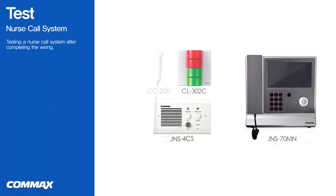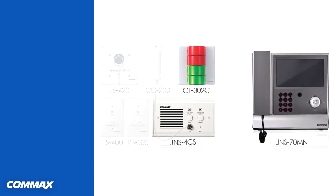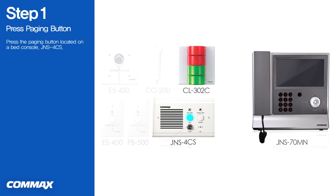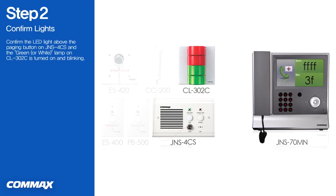We would like to demonstrate how to run an initial test after wiring is completed. First, press the paging button located on a bed console JNS4CS. Please confirm the LED above the paging button on JNS4CS is on and the green lamp on CL302C is turned on and starts blinking. Please confirm the JNS70MN displays FFFF room on the screen, indicating a patient from the room FFFF is calling for a nurse.